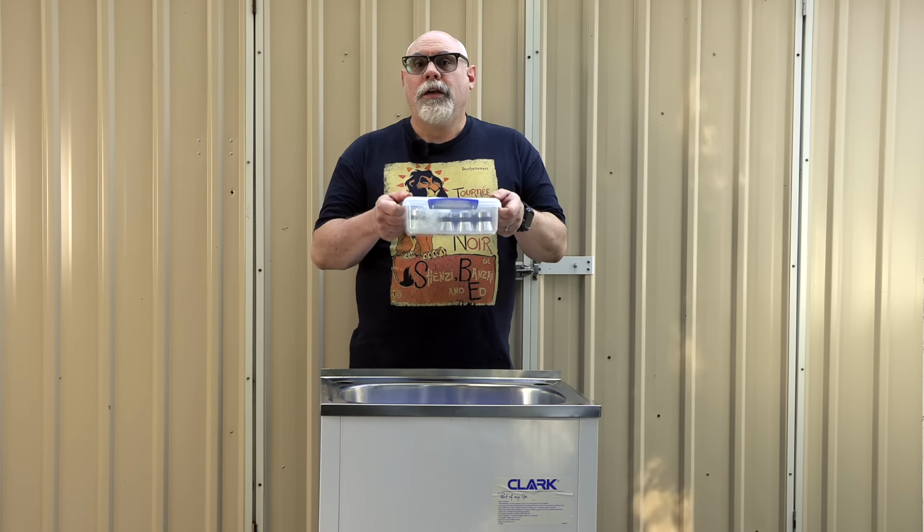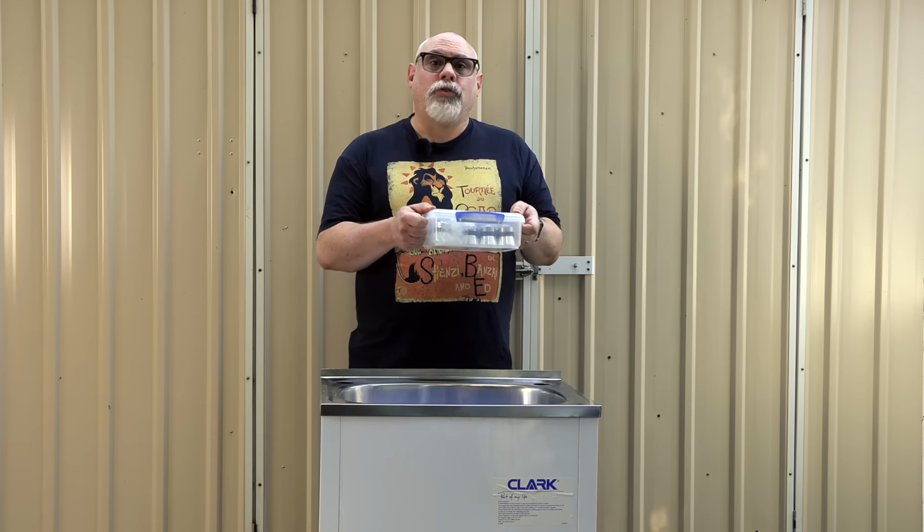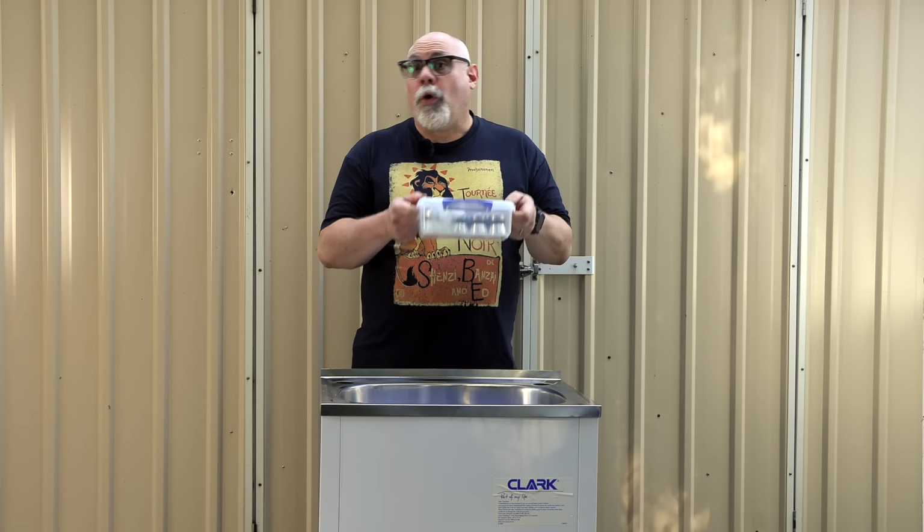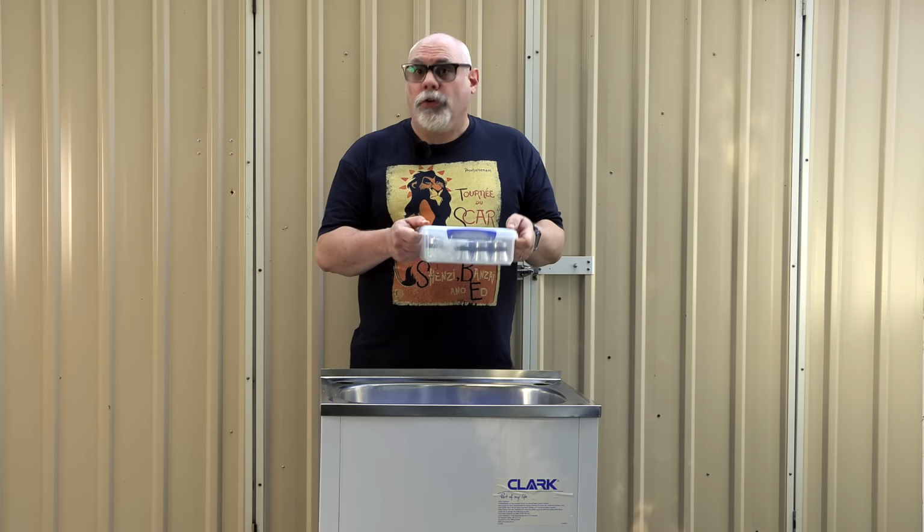I should also mention that if you run a transducer with a dry tank or a tank with a lot less liquid than the transducers were designed for, they can overheat and die. So it's important the tank is filled up before they get switched on. I have 12 transducers here. A 120-watt ultrasonic driver can power 2 of these 60-watt transducers at once. So I'll need 6 drivers, which is good, because that's how many I have.